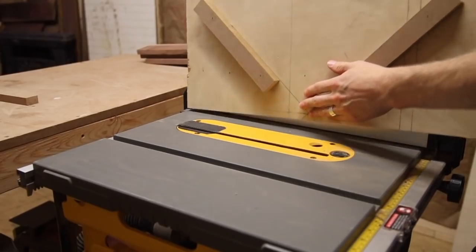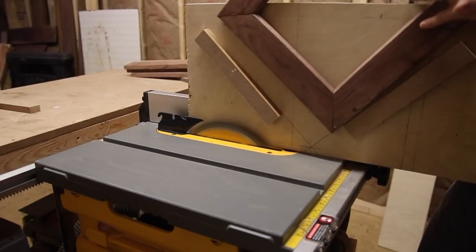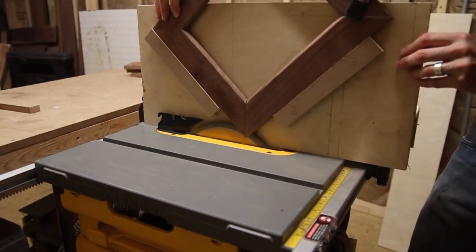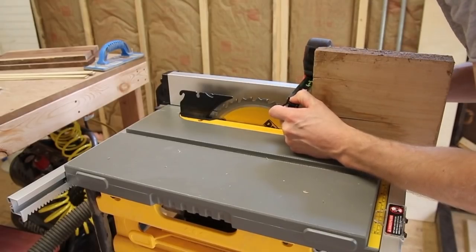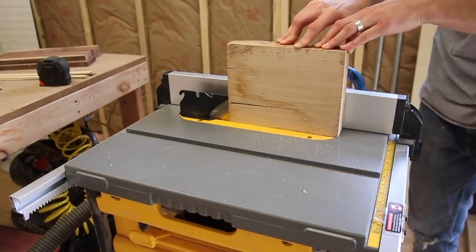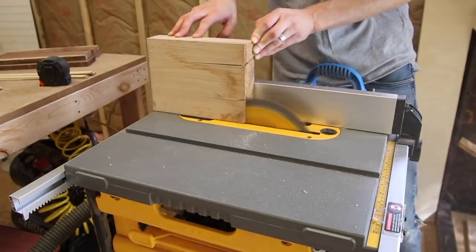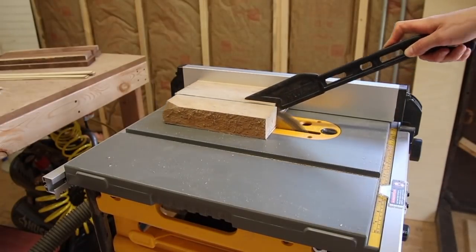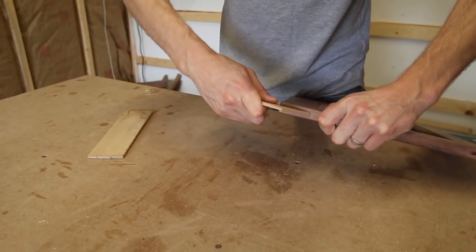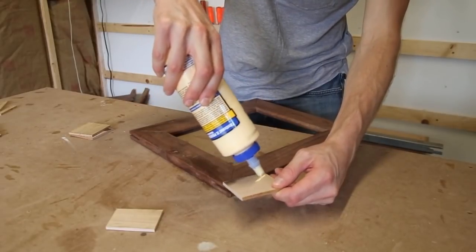After the glue was dry, I decided to add some splines to the frame just to add some strength in the corners where the glue joints were. I made a really simple spline jig to do this — I learned about splines and this spline jig from David Picciuto's channel; he has a really good video on picture frames and I'll link that in the description. For the splines, I measured the thickness of a piece of maple I had and ran it along the table saw, flipped it over, and ran it again. My blade didn't go up high enough to make one solid piece, so I just cut it off and used that as my spline. After dry fitting the pieces and cutting them to a more manageable size, I added glue and glued them into place.